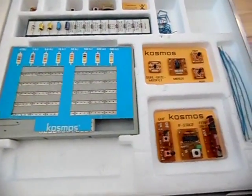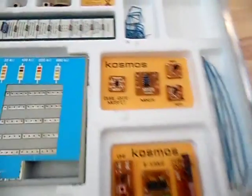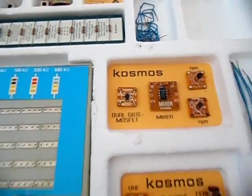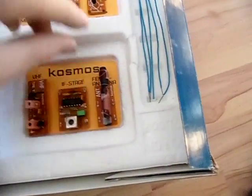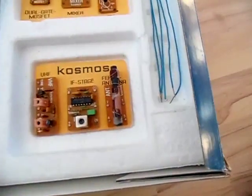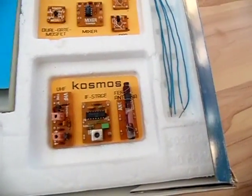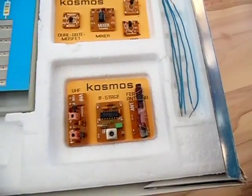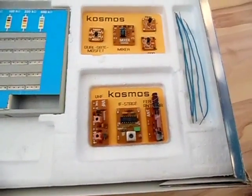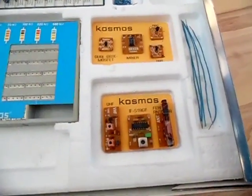There's also no shortwave section, which would have been really simple to add. I did my own experiments: I built a regenerative receiver using the dual-gate MOSFET, then took the coil out of the ferrite bar so it had just a few microhenries — and I got a shortwave receiver. I was hearing the 49-meter band. They could have mentioned this simple modification for shortwave, but there's no mention of it in the kit.